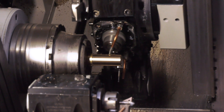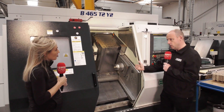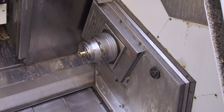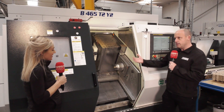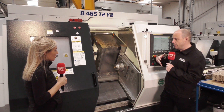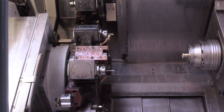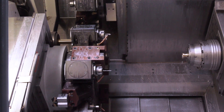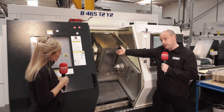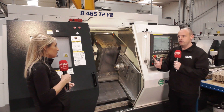The second reason — and probably the most compelling — is what we have here on the sub spindle. This sub spindle will move backwards and forwards, up and down, as well as in and out. What that enables you to do is a few things. Firstly, you can move the second spindle almost out of the way so that potential collisions or creation of tool paths is far easier. You could also incorporate a tailstock into the upper or bottom turret, which means you could support a longer component being machined in the main spindle.